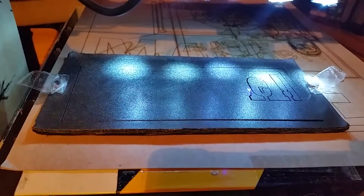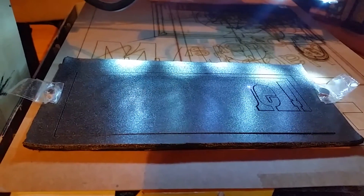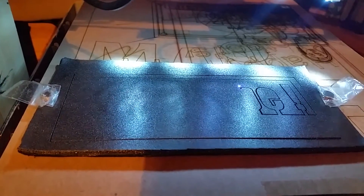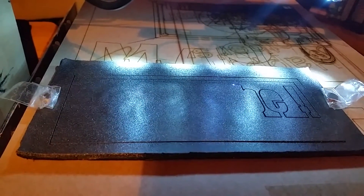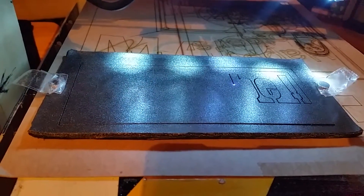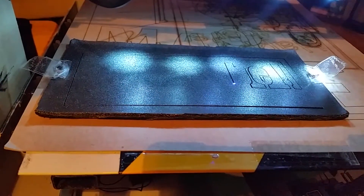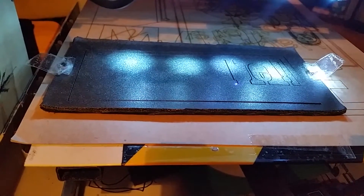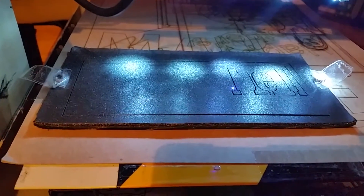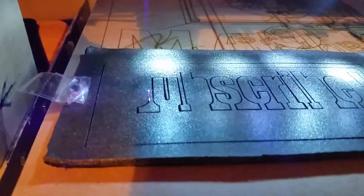You really want a fairly powerful laser with a fine point or focus to the beam width, and go at a pretty quick pace. I'm not sure if this is going to turn out as well as I'm expecting — it does have a few narrow cuts in these letters. What they might do is melt in on each other, or possibly melt the foam around them, or the little bridges at the bottom of the text might not be substantial enough. I'm going to pause this and catch back up when it's got a bit more done.